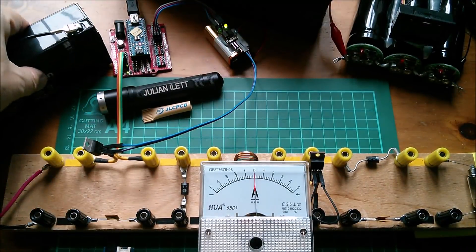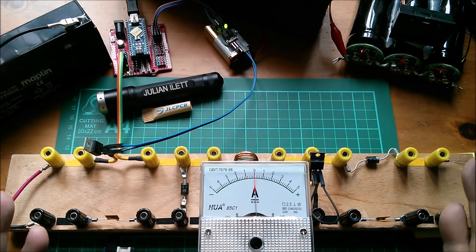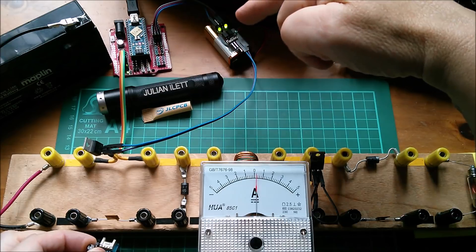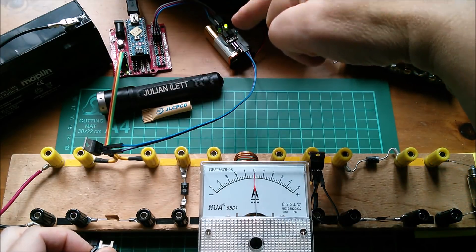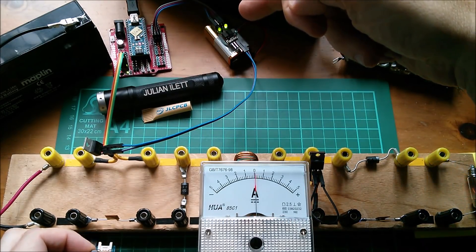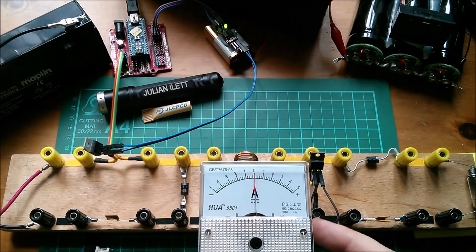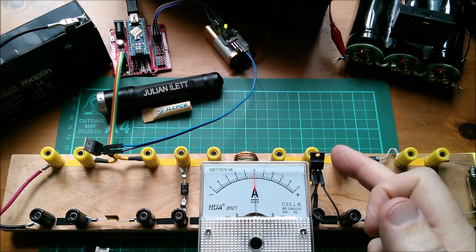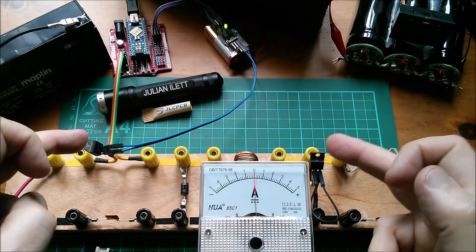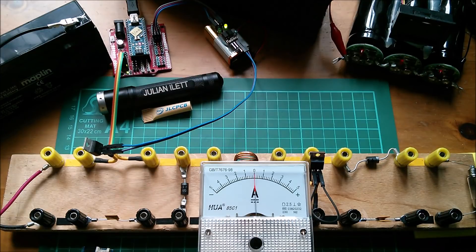Before connecting a heavy duty power source to a heavy duty power receiving thing, there are a couple of gotchas. I've got a simple PWM program in the Arduino and turning the pot switches the MOSFET driver from off to on - the ammeter goes up, the bulb comes on, and I can vary the on-to-off ratio. Note that when doing buck-boost experiments, both MOSFETs are under Arduino control - if you turn them both on, you've got a direct current path to ground from the lead acid battery.